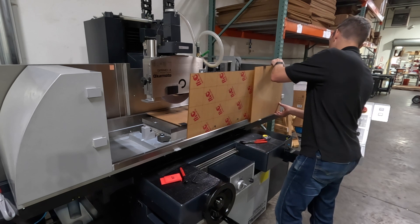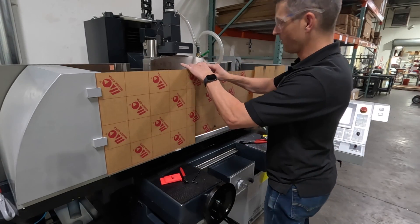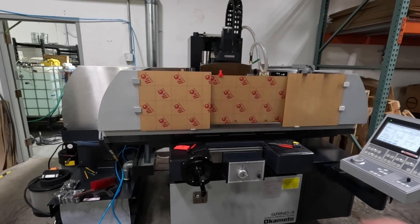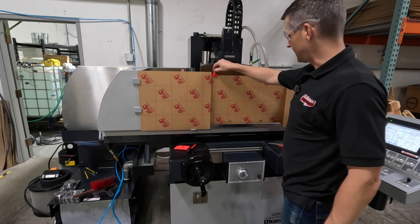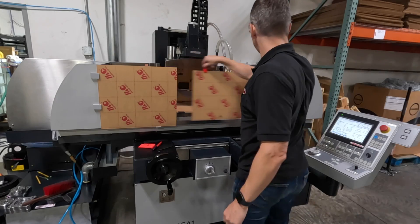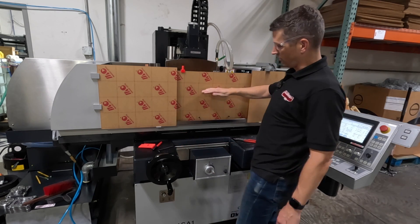I haven't pulled the protective covering off the acrylic yet, but there's a temporary handle idea here that may become permanent. If we pretend this is clear: we grind, we've got pretty good overlap protection. There's still the angular alignment to work on — it's tipping forward, which isn't the worst, but it'll catch on a door hook. Actually, that hook supports the splash guard — I could just unscrew it since I'm not using it anymore. So consider that solved. The trade-off now is how far open we want it; the curvature limits travel, but it should be fine and will certainly stop the coolant.